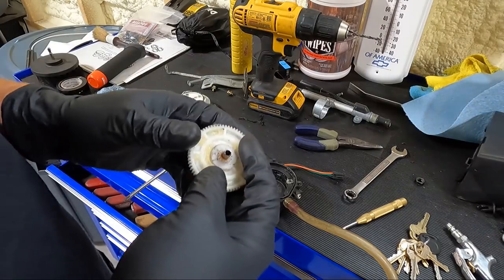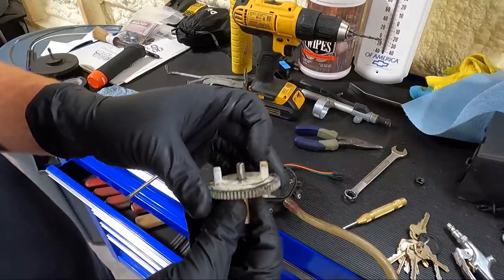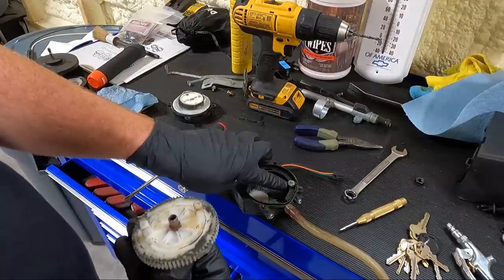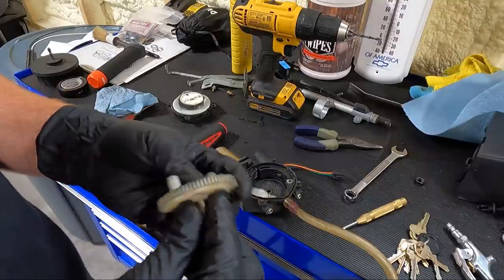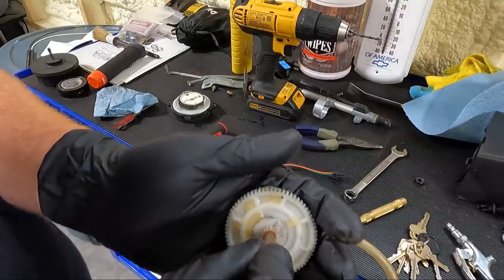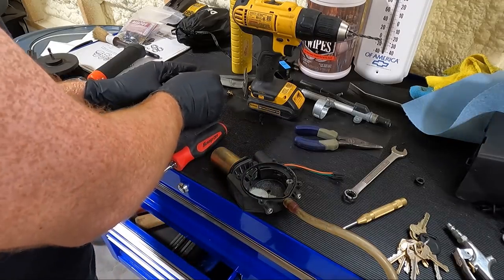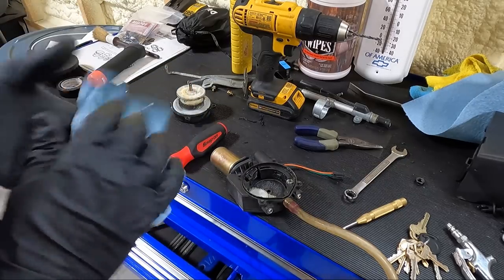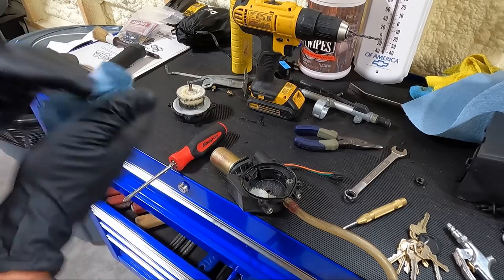I'm down to nothing — there is literally not one piece of that mast left inside here. Maybe it just disintegrated; it's just plastic. I want to show you this: this pin comes out of the middle, this bushing comes up on the side to get it out, and when I took this out there is a piece on the bottom here with a small little washer — that washer goes in between those two pieces of plastic. Just be careful taking it apart because stuff will just fly out everywhere. At this point we're ready to go back together. I'll clean this all out and put some new grease in there.